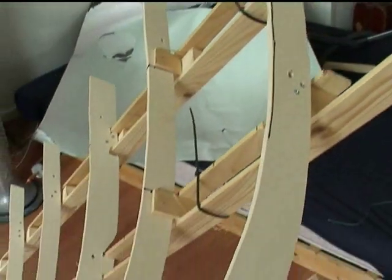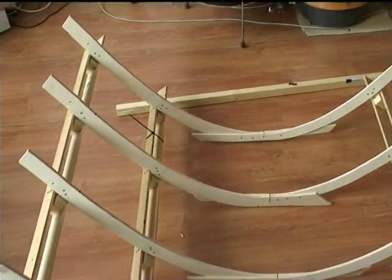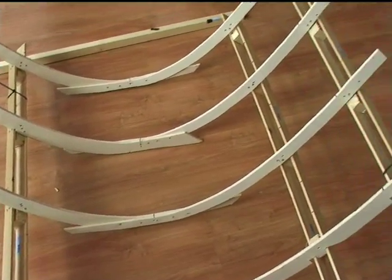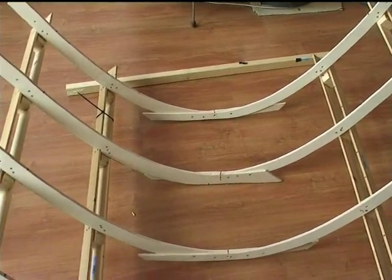Just a little bit about how I constructed this trough shape. I drew a parabolic shape, which is very easy because you can calculate it. Then I copied it and cut it out of this kind of multiplex wood. I simply connected them together with wood. At first I used some metal rods but I replaced them with these little connectors. You can do it in many different ways — it's all about achieving acceptable stiffness.